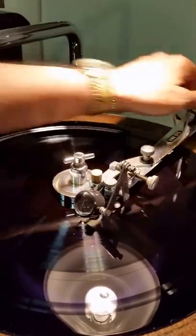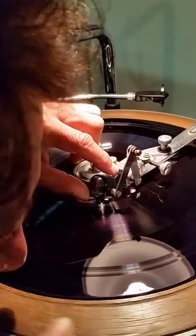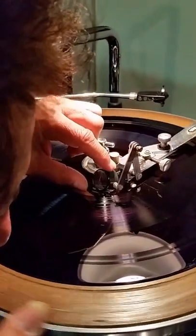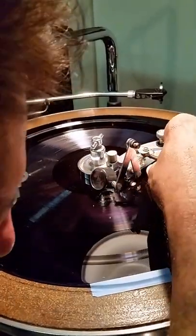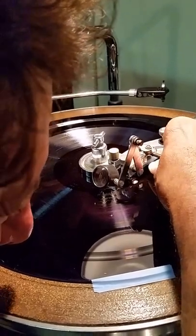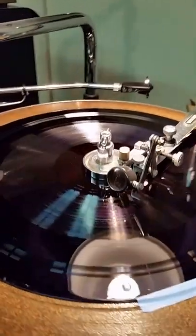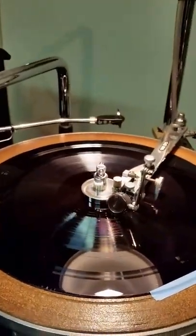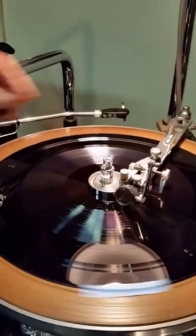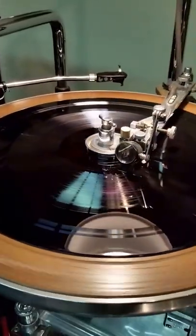So what we're going to do is lower this a little bit, then we have to match up this stylus with the finishing groove. I've got to turn this until it comes up. Right now the stylus needs to be moved a little bit. Now I've got that positioned in the right place. We're going to go to 33 and a third, actually, just to do the finishing groove. We'll lower it just for the finishing and then lift it, then inspect it to make sure it's correct.